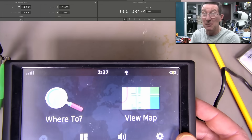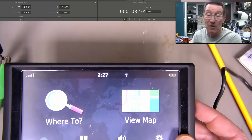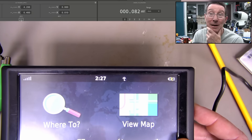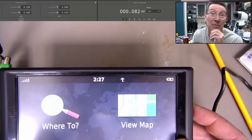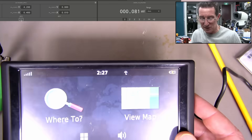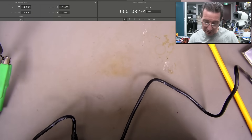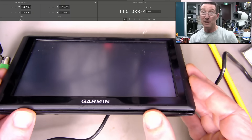So there you go — that's just another case of a battery at 2.5 volts that probably went into under-voltage lockout. We just need to give it a little kick up the pants. Not sure why the external USB supply couldn't do that, but once I hooked up the power supply it goes into constant current straight away, feeding 400 milliamps constant current into it — no worries — and it seems to have come good again. I think it's potentially one sick puppy still, but I'll get a new battery for it and we should be good to go.